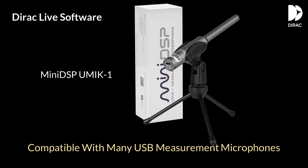All right. As I mentioned, you need to get a mic. So this is actually one of the most popular mics utilized for Dirac calibration. You need to have a USB mic, which means you can plug it into your computer. This is a miniDSP UMIK1, and it runs about $79. There's a better version of this called a UMIK2. That's a little bit less than $200, a little bit more precise.